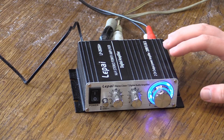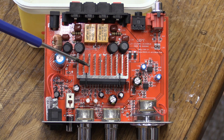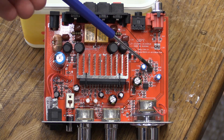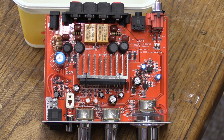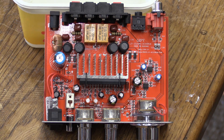Let's go ahead and take this thing apart and see what's inside. As you can see, there is really not a whole lot to this — though there is plenty of surface mount devices, plenty of SMD circuitry, so it is quite a bit more complex than it may look. We have, as the heart of the circuit, the TriPath TA2020 integrated digital Class-T amplifier chip. And then off to the side we have as the pre-amplifier for both channels the JRC4558 op-amps. Other than that, this circuit board does not give away any sort of a design date. We do have the speaker relays up there, of course.